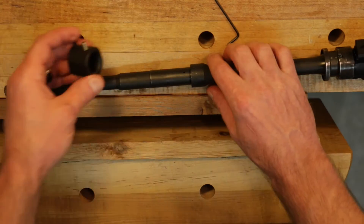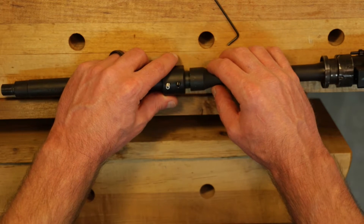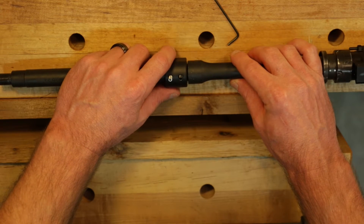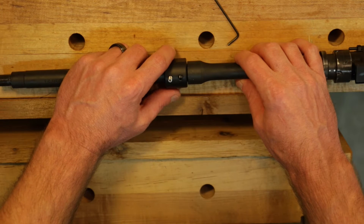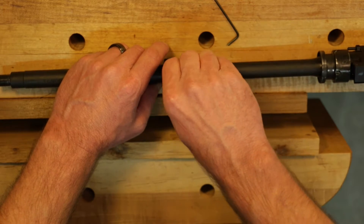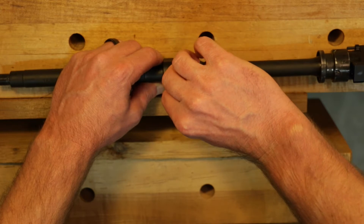The first thing we'll do is install the jig onto the barrel. I'm just tightening down the black screw just to where it starts to bite against the barrel, and then I'll slide that screw to meet up with the gas port hole in the barrel — and you can hear it click or kind of seat into that spot. Now that I've got it seated into that gas port, I'll thread that down and let it seat itself. Once it's hand tight, I'll take my hand and tighten this soft-pointed set screw, and then use the provided Allen key to further tighten those screws down.